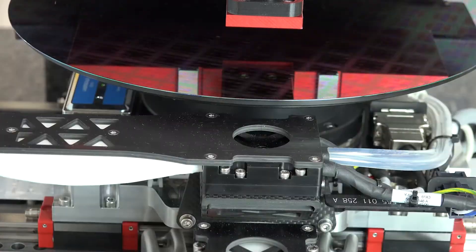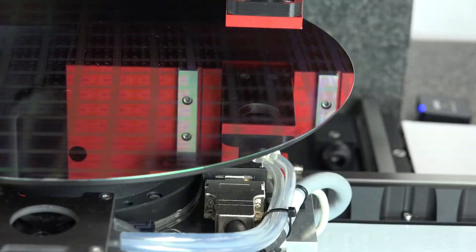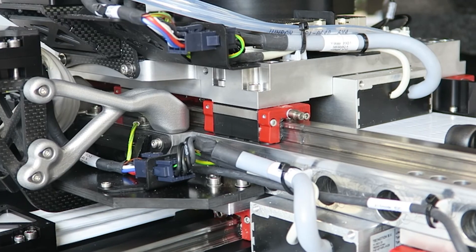You can simulate on the CAD or measure it on the stage, but first of all you have to build one stage and then you can see what resonances are affecting the axis tuning and how much. We have powerful tools here at Schneeberger to measure the resonances and also to simulate it on the CAD, and it matches very well — so we can measure what we simulate and therefore we are able to improve the system further.